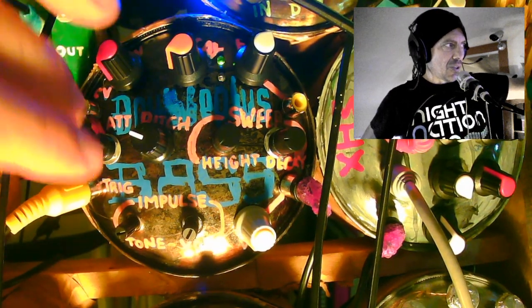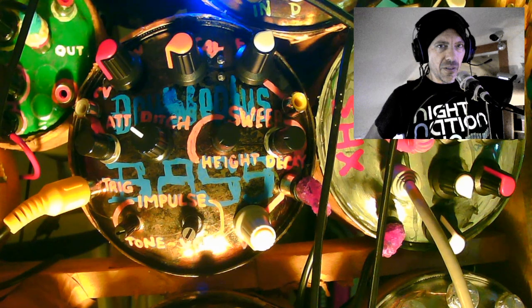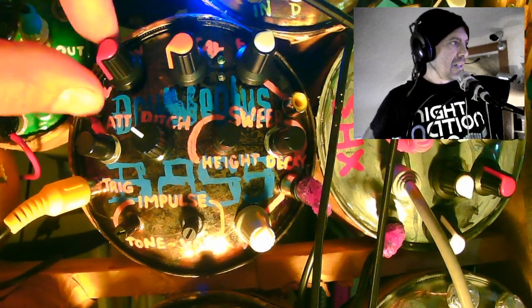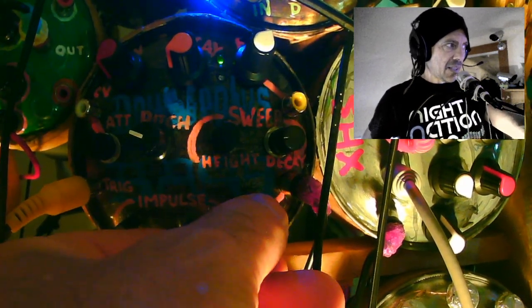The core of this kick drum is a triangle wave VCO — that's what we're listening to right here. It's slightly buzzy; you can hear a little tick on the tips of the sawtooth. One of the magic things I'm really happy with is the wave shaper that takes the triangle, moves it through a sine wave into something pretty magical. Let's listen to that for a second.